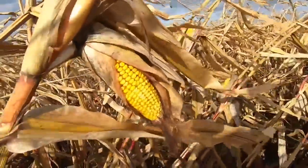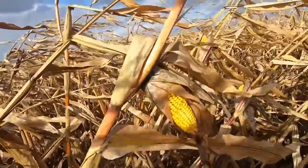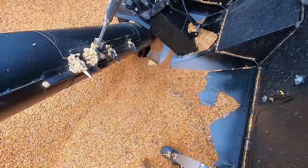Another component of the ACROS 595+ are the hydropulsators. These are vibrating elements mounted in the rotor area that, under load, begin to agitate and help move the material through.